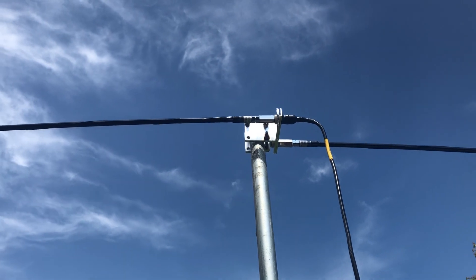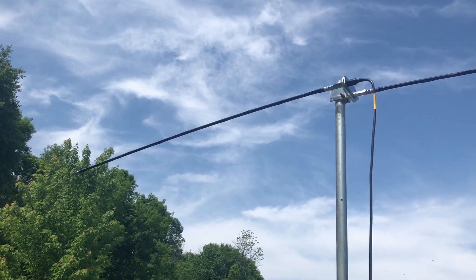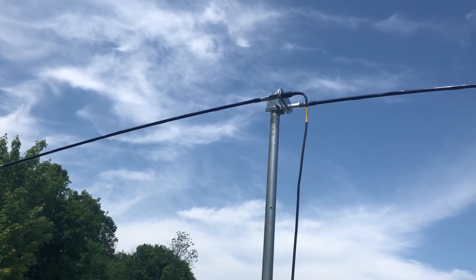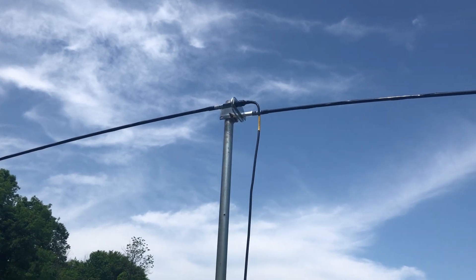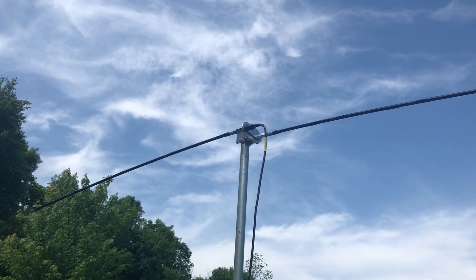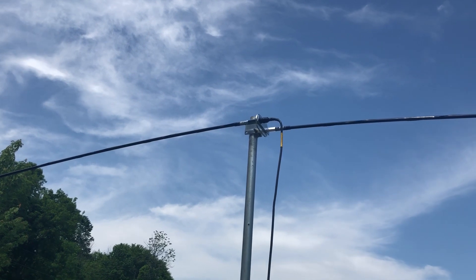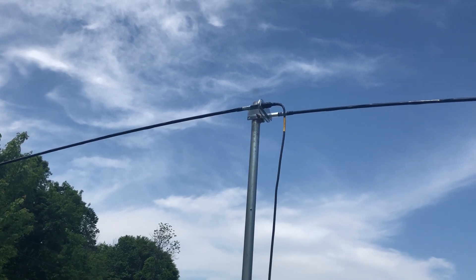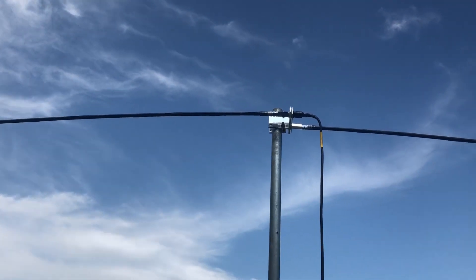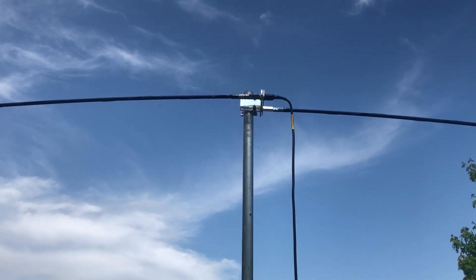After tax and shipping it came to around $75 — and that's just for this assembly with the whips, not the pole or the coax. They also make other versions up to 80 meters. It's a single-band antenna, very flat on SWR for 10 meters, and it receives pretty well on other bands too, though SWR on those is screaming high — I wouldn't dare transmit out of band. Across the full 10 meter band at 28 MHz it was super flat without a tuner.